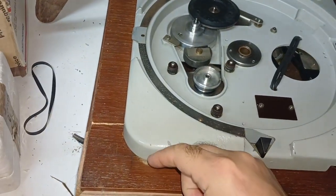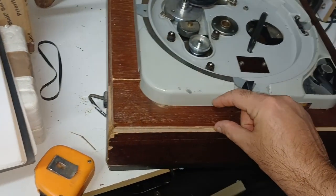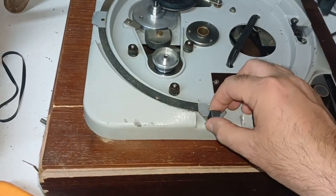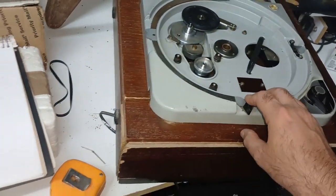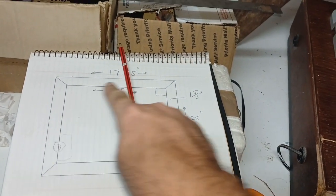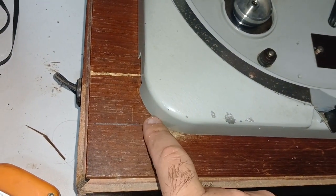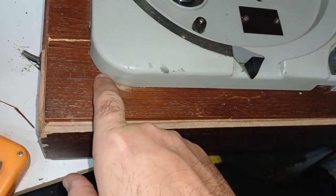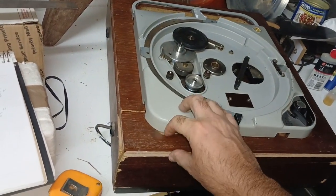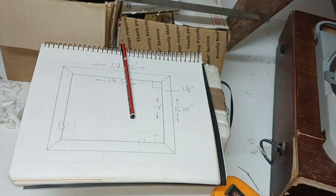But I did look at it and figured that these dimensions would be pretty much exactly the same as this plinth right now, which is a bit too wide. I find this ledge is too wide. So what I'm going to do is cut an inch off of each piece, reduce each of these pieces by an inch. And that will shave a half inch off of each of these lines in the corner here. And that will make this gap disappear, right? So that's what I'll do. I'll tighten up a little bit from here, taking an inch off each piece.